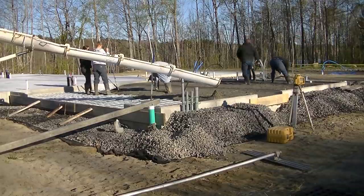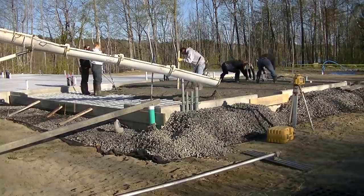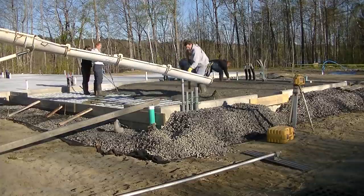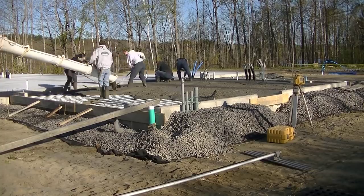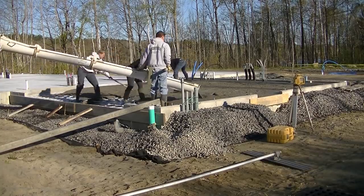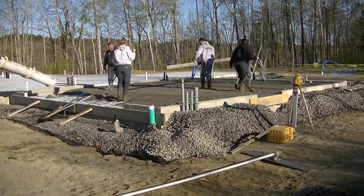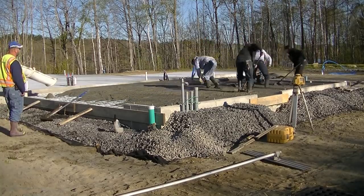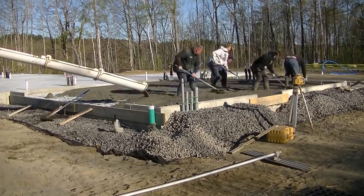There are two inches of styrofoam under the radiant heat tubing to help hold the heat into the concrete floor. We're using fiber mesh for reinforcement. My job was hired by the foundation people just to come in with my labor to pour and finish today — I didn't design the floor; an architect or engineer designed it. We're just here to pour the concrete and power trowel it smooth. The mix design for the concrete wasn't my choice either; that's all part of the package with the general contractor.